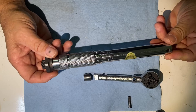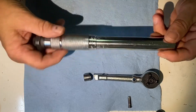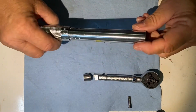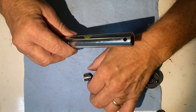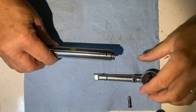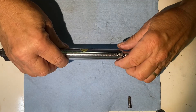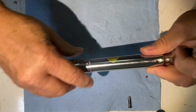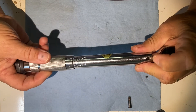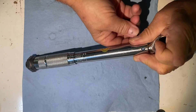Calibrating it is a whole different thing — I'm going to use a weight to calibrate, but that'll be a different video. Now we want to put these two parts in the barrel, maintaining the relationship between the bevel. The beveled end goes in this way. Push it in so I don't mess up that relationship. The adjustment barrel wasn't back far enough so I backed it off, keeping pressure on the head so we don't lose that relationship, then put the pin on.